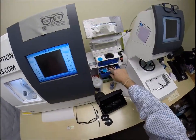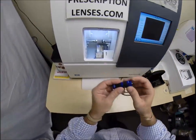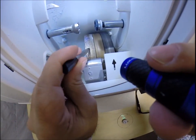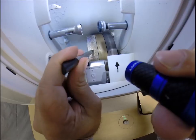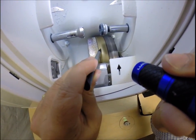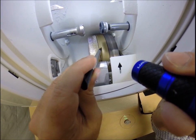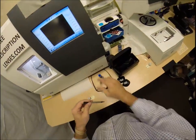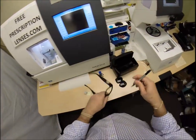So, the actual cutting wheel is over here. It's going to act like a heavy grit sandpaper to grind away the lens material until it's the final size. This wheel in the center that has that channel — that valley, that recession — that's what's going to put the V-shaped bevel onto the lens so it stays inside the bevel of the frame.